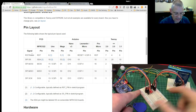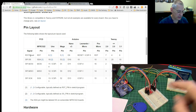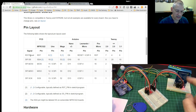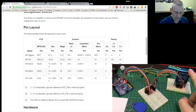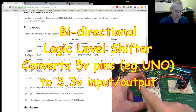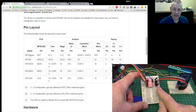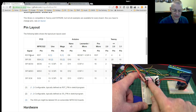As I said in my previous video, this board here is 3.3V and the Arduino is 5V. If you connect this directly to that — kaboom — this would no longer function. So this thing in the middle is in fact a logic level shifter. You put all your 5V things in one side plus 5V, and all the low voltage 3.3V things in the other side, and this thing in the middle does its magic.